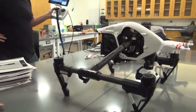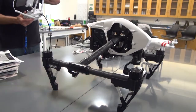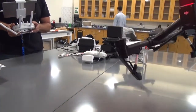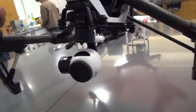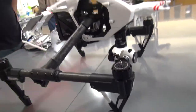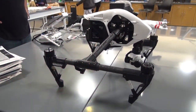If you're flying as a single operator FPV, what function mode do you put the gimbal in? I have it in follow mode. So if I rotate the aircraft, that gimbal is going to stay in the same direction — it's going to stay stable. So wherever the single operator points it from his controller, no matter what the aircraft is doing, it's going to keep looking forward. It'll adjust for some yaw input — it's got about a 20-degree yaw compensation for wind shift or turbulence. If he puts the slave version on it, the camera goes 360 degrees wherever the camera operator wants, independent of the aircraft pilot.